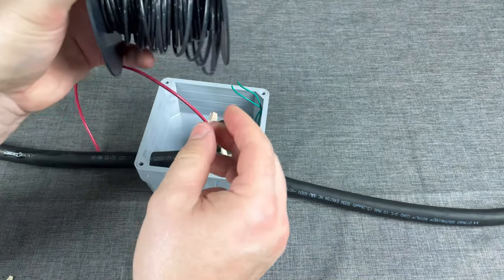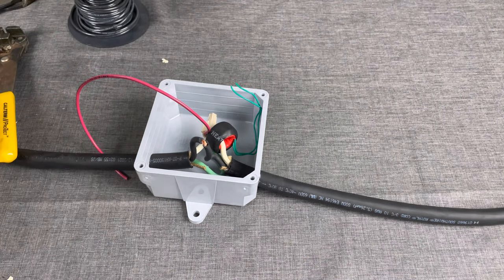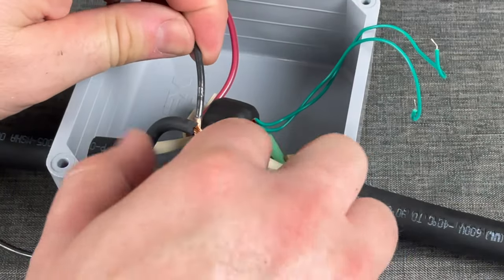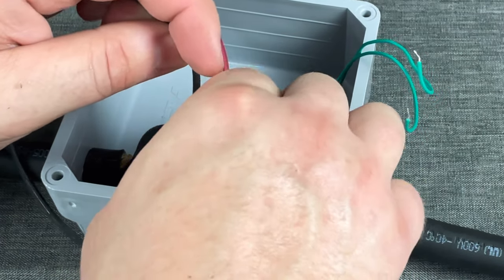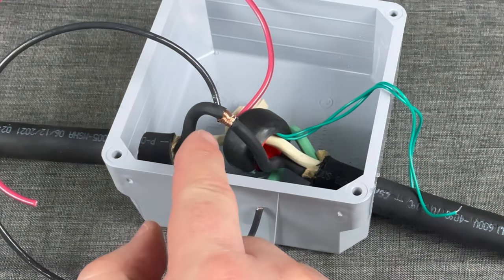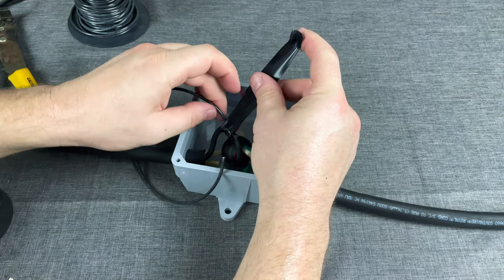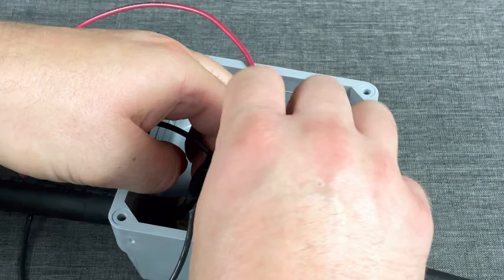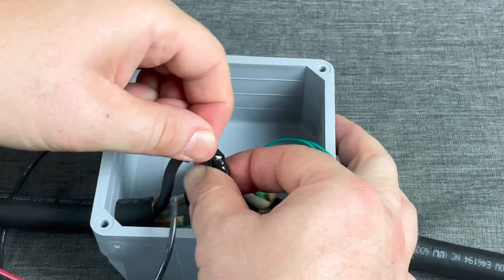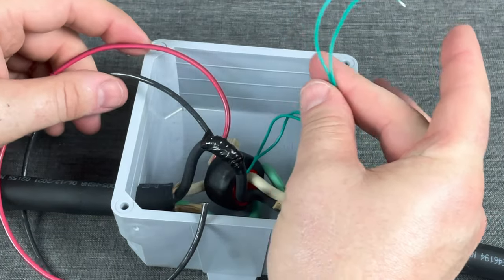For the black wire — we opened that sheath and we're going to add another black wire to it. Cut off the same length and strip off the end. Now wrap this wire around the black one; in the video I twisted the wire from the back side. After you twist and wrap it around, it'll be nice and flush. Get a piece of black electrical tape, wrap it around with some tension to make it nice and tight — that's what holds it in place.